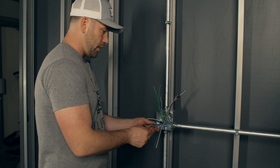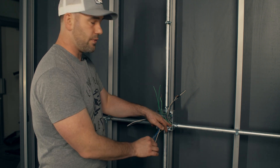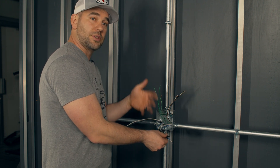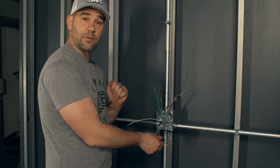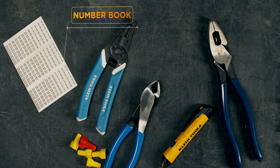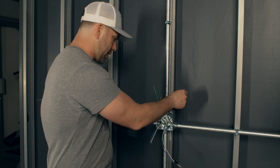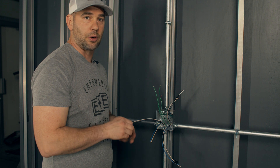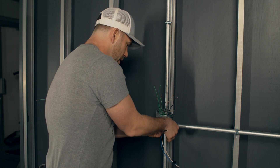Another thing I'm noticing is that this blue and white right here — this hot and neutral conductor — is taped down at the conduit and not identified at the wire. So whenever I go to cut these, that combination label is going to be gone. I want to always think about the person coming after me, whether they're adding wire to this box or troubleshooting. So before I cut this, I'm going to take my tape — or if they were numbered, you'd use a number book — and identify it at the end of this conduit.